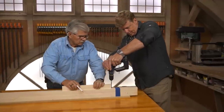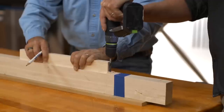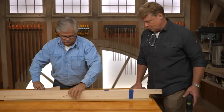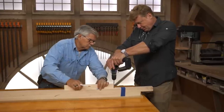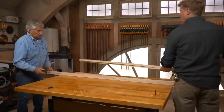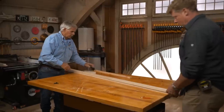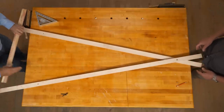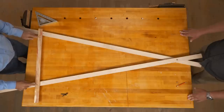I made a little jig so it will hold the drill straight in both directions. Now we're going to do the other one — center your line, line up the spacing, go for it. We removed all our tape and our pieces are all set individually. Next I need to find the angle for the legs and how they sit on the floor flat. I'm going to take a bolt and put it in that top pivot point and spread the legs apart. I know the dimensions of the rack we're going to put on the bottom, so I took a scrap piece of wood and drilled a hole to the center of the pieces that make up the rack.